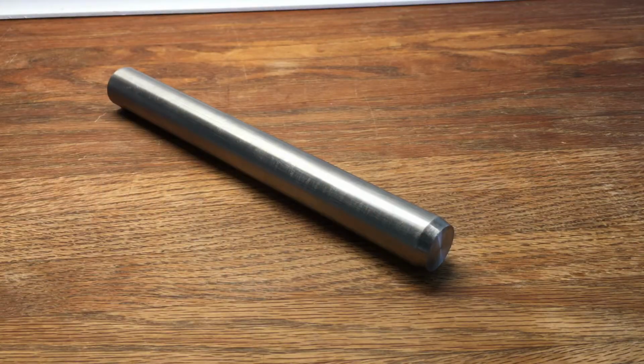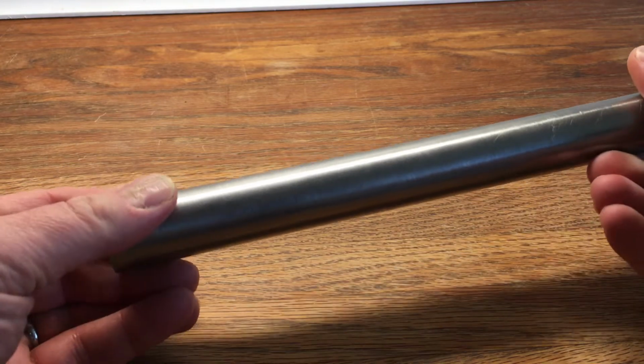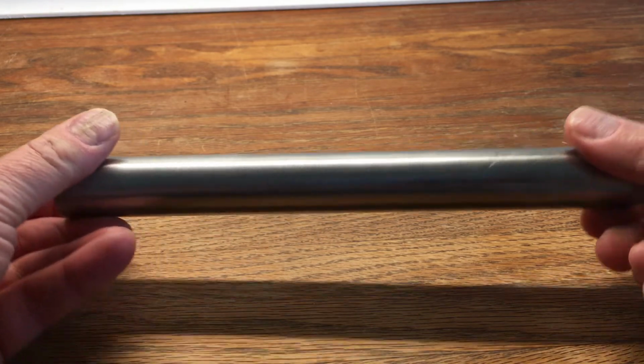First, let's prep the shaft. Disconnect your shaft from the coupler and remove the existing unit. Then examine your shaft for anything that could damage the seals during installation, including pitting, nicks, sharp edges on the keyway, and set screws. Polish those areas smooth.